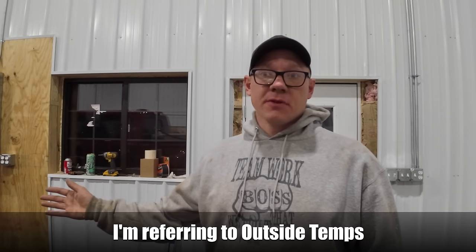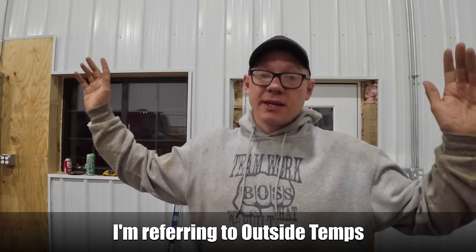Yeah, but all the acoustics aside, the big thing that I wanted the spray foam for was the temperature control. And man, the difference the last few days in the temperature. Overnight it gets down into the 20s and 30s, and then in the daytime it's up in the 50s. Well, if I open up the doors during the day and then close them as it starts getting cooler in the evening time, it has been still 40, 45 degrees in here in the morning with no heat running in this building whatsoever. So that's been awesome. And that's definitely gonna be a giant help come extreme heat and extreme cold time of year. So definitely looking forward to that.